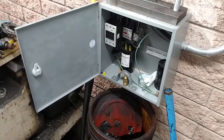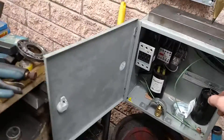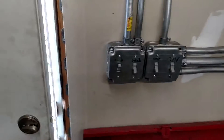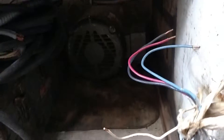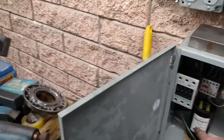So what I've got here is a contactor — two contactors actually — a little relay, and then over here on the wall, three phase into my three phase maker, on and off whenever I desire. Down here behind the lathe I've got a 10 horsepower three phase Y-style motor. Up here I've got a circuit breaker for my phase maker — two legs — and I've got a big giant capacitor, 300 to 360 microfarads.